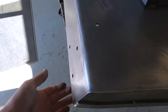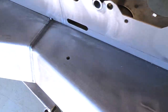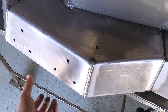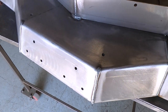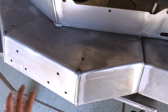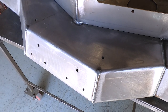Even if you have a soft bumper, it'll still bite in and the mower will pivot towards whatever you're hitting. So it really comes down to not necessarily protecting things all that much — we want that clean cut to the last edge. Our wheel brackets are removable, so if you were to hit something solid and blunt, those brackets are made to bend before the deck itself. Overall, that's how the deck is constructed — we want a lot of rigidity but not a lot of weight, and that's how we got to where we are with these designs. Hopefully that's helpful and I hope you have a great rest of your season.